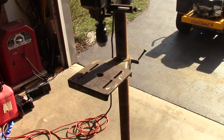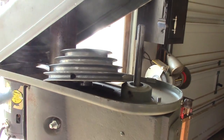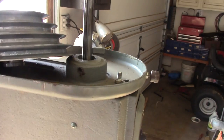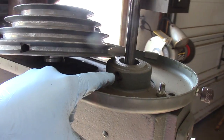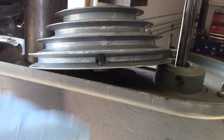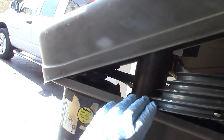I'll start out by taking this thing apart. The top case has three bolts going around — they're just little half-inch bolts — and the main pulley up here has a set screw at about three o'clock on the left side of the drill. You've got to go through that bottom pulley and that loosens up everything. This should just lift off.